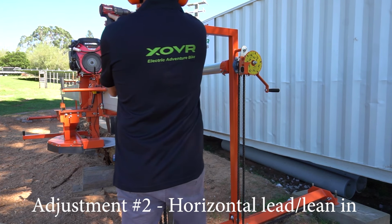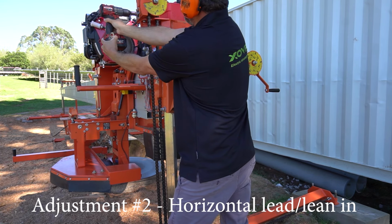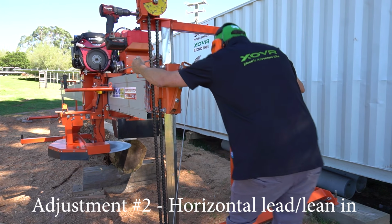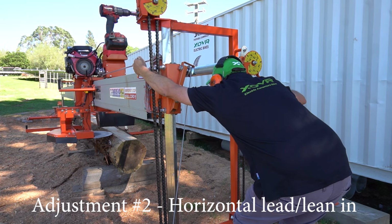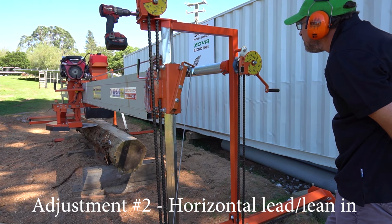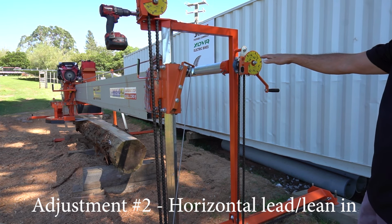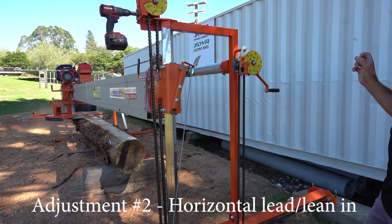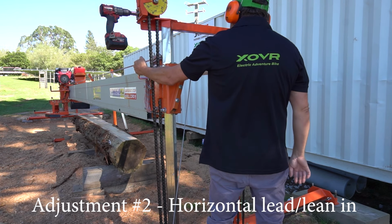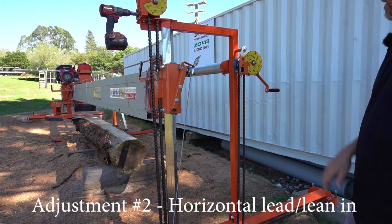Too low. So we send it down and bring it back and then move over another 2 inch. And between those two cuts, you'll see that line. So go out of the cut, bring it back into the cut slowly. So you're making sure that you've skimmed it front and back.